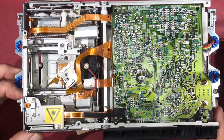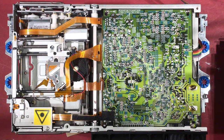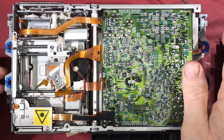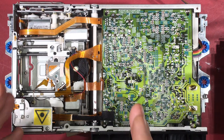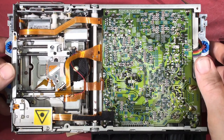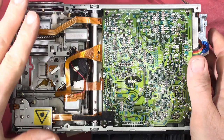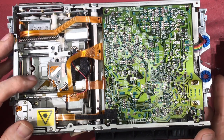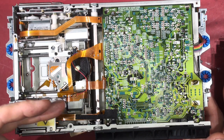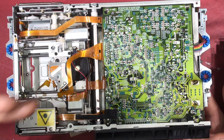The main culprit is a very common fault — I did a video on this about four years ago where I repaired one of these mechanisms. What happens is the CD mechanism no longer works; you can't eject the cartridge. Often the CD is stuck halfway and can't be driven in or out. The reason is this carriage that goes up and down to line up with the CD — the drive has gone, so there's a breakdown in the mechanical drive of the carriage.